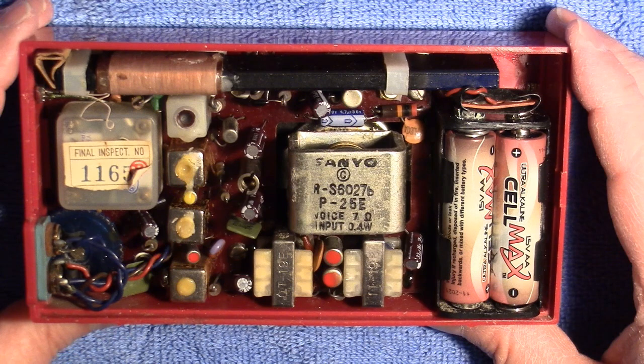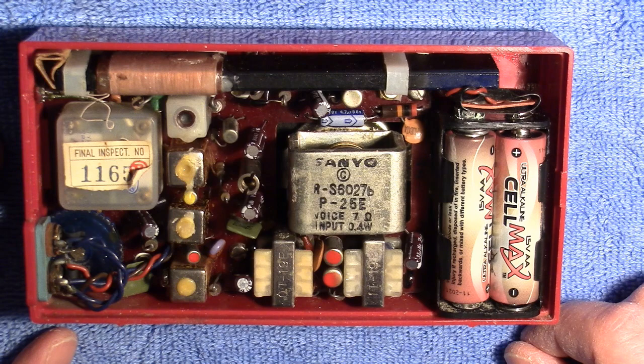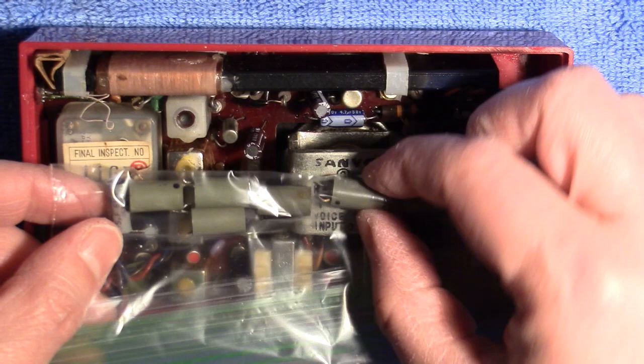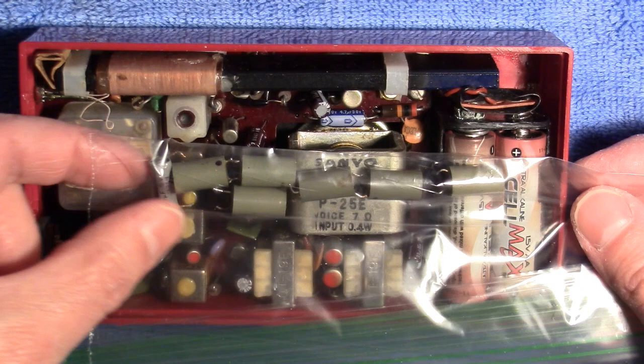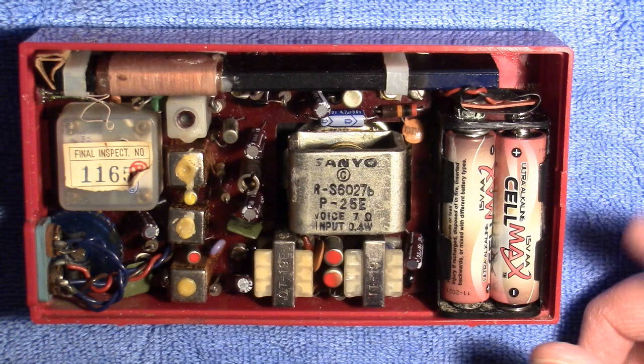Now, I wasn't really a hundred percent sure that it was a capacitor problem, but I figured they're old anyway, so I went ahead and replaced them. Well, I did that. And these are what the old ones looked like — they didn't have plus or minus marks on them; they just had a little dot on one side that denotes the negative side. The newer ones are about the same height but maybe just a little smaller in diameter — but pretty close.